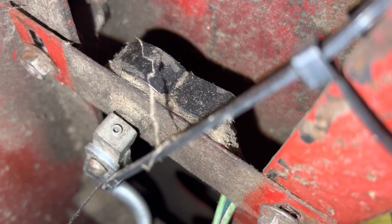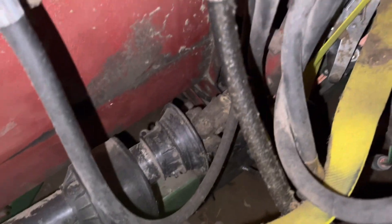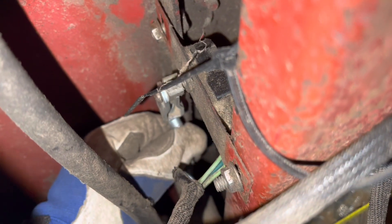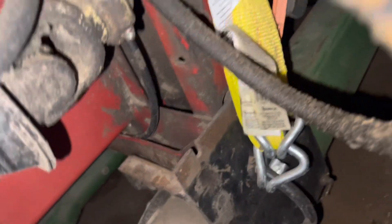That right there is your auto header height potentiometer. If you're looking for it and don't know where it's at — here's where your feeder house would go. Just to the left where all your hydraulic connections are and your PTO hookup — it's right there. You can see there's this linkage right here; that's actually what turns and moves that pot. And there's a cable right here that runs down — that's what's sensing the header height off of the ground.